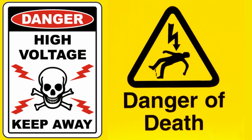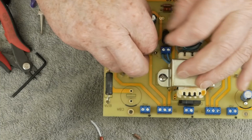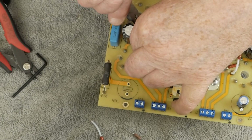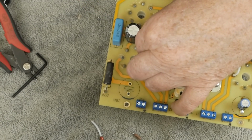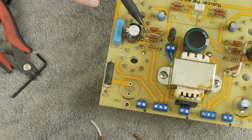And then finally, we're going to use a 510 ohm resistor to triode strap this input tube, and we're going to put it in here. And I know you can't really see what I'm doing, but that's kind of a necessity here as I solder this together. And one end of the resistor is tied to this lead on this resistor.